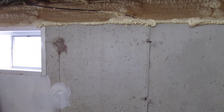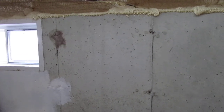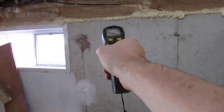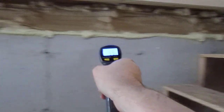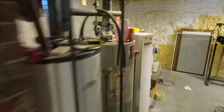Just showing, after I had closed-cell foam insulation done, what the temperature of the outside walls looks like using an infrared temperature gun. If I point it at an exterior wall, it's measuring at 57, 58, 59 degrees. So that's untreated, and this is an old part of the basement which I had foamed.